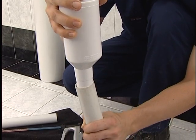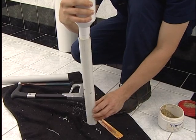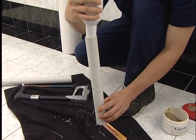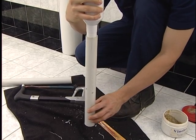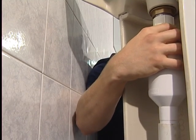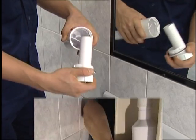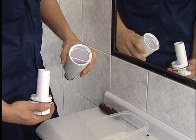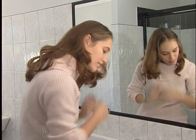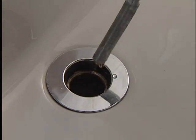When the trap is installed, it only needs to engage on the o-ring by about 10mm or ½ inch. This gives a large tolerance in the pipe mount without sacrificing the seal, and is most forgiving even if the pipework has been set out in the floor at a slight angle. The internal design of the trap is self-cleansing, which minimises blockages. Also, if you accidentally drop something down the plug hole like valuable jewellery, it remains visible from the top for easy retrieval.